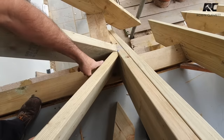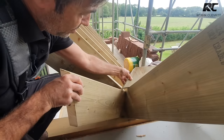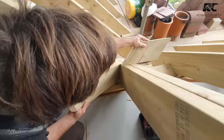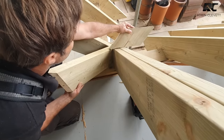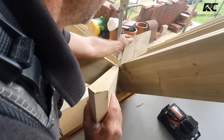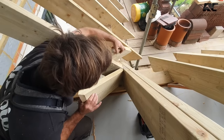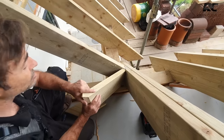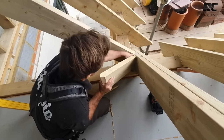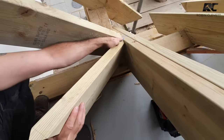Our valley intersects at center — the shoulder on one side doesn't come up to the shoulder on the other, because when we put battening on it comes through and meets the center of the valley. If you raise your valley rafter up too high, especially with a thick member, and put battening on the roof, it rides up and goes a little bit out of shape. So the center should meet the center. When using valley tiles, we bring the batten right into the corner, and the returning ones equally come into the center. Measuring directly is quite tricky.